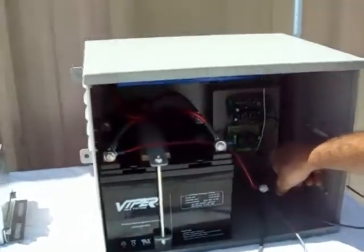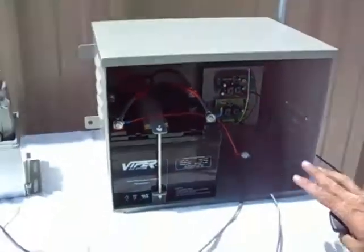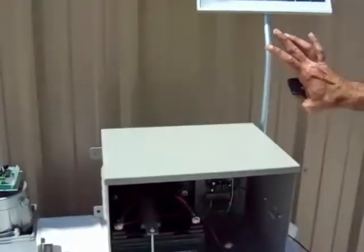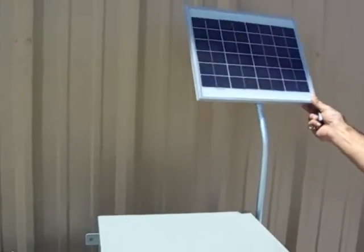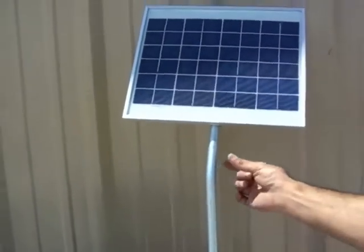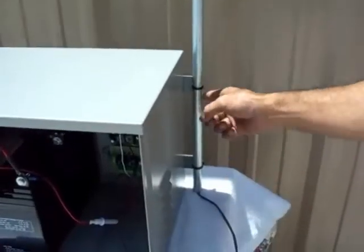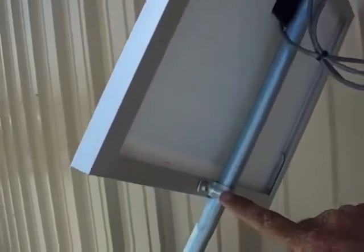When the timer turns off, it turns the inverter off to prevent overheating and to prevent draining the batteries, so you maintain your charge. The batteries are also continuously receiving charge from the solar panel, which you can position toward the sun as needed. For my setup, the solar panels do not come with installation gear — I simply used a half-inch electrical conduit to run the wire through, and on the back I used simple wire clamps and C-clamps to connect the panel to the board.